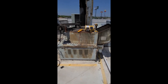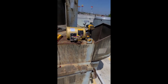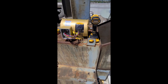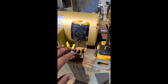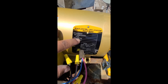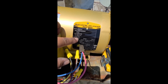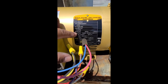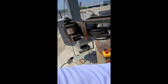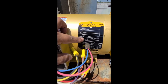I'm going to do a quick video on how to wire your new motor. It's got an A66 belt — the belt has a crack on it, so it's bad, and I've got a new belt. When you're looking for your replacement motor, your cat number is your model number. Then you want the correct voltage — notice there's 230 and 460; those are huge differences, you'll hurt yourself if you do it wrong. Also check the amperage and make sure the RPMs match. On this motor it's 1725; the new one is 1755 — a slight difference, that's fine.